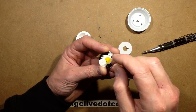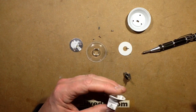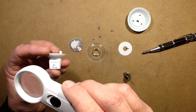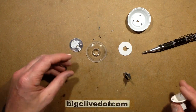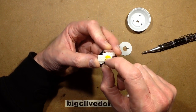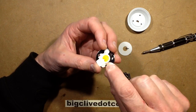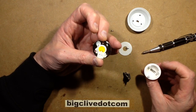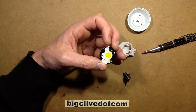There's a good chance — and the text is microscopic — it's rated at 5.5 watts, so it's going to get pretty hot. I'm guessing maybe it is just thermal stresses that have cracked one of the bond leads off either an LED or the connection onto the pin arrangement. It's a fairly common failure mode — we see it so often in high-power LEDs where the bonds fail.